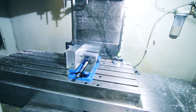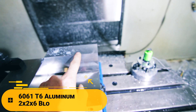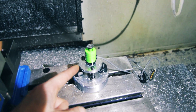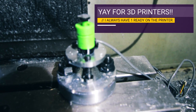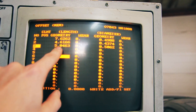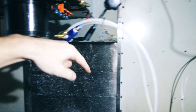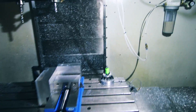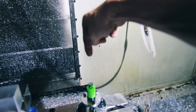Right now what I'm up to is I am cutting these blocks into soft jaws. Check this out - I crushed this the other day, that's my tool setter. Just before New Year's Eve I came down and forgot to program that length in there. It was a zero, so the machine thought the tool bit was way up here and it just came down and flattened it. I do my H offset up here so I knew something was wrong, however it was not enough time to save that probe completely.